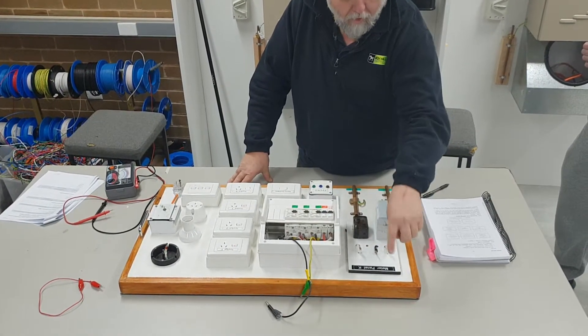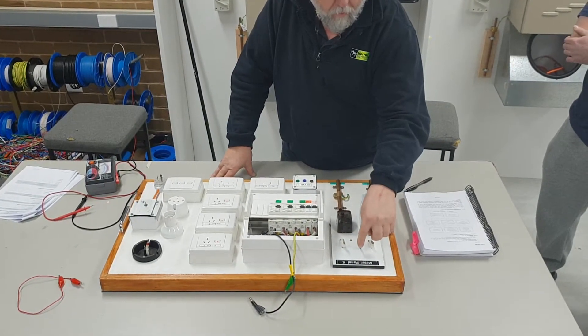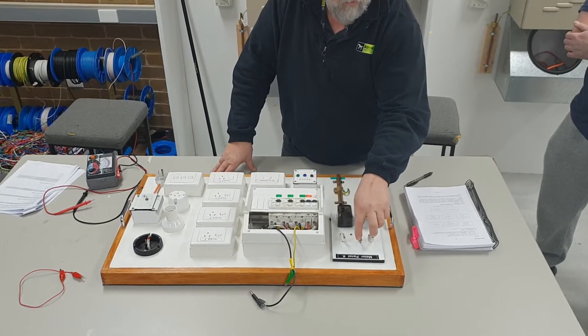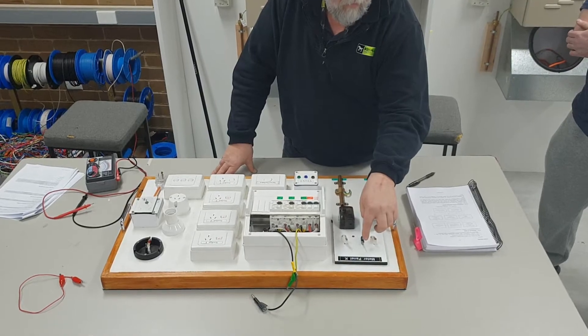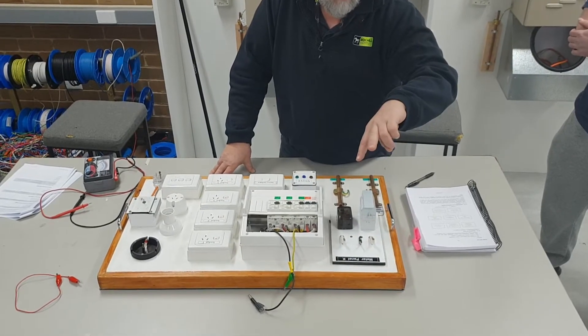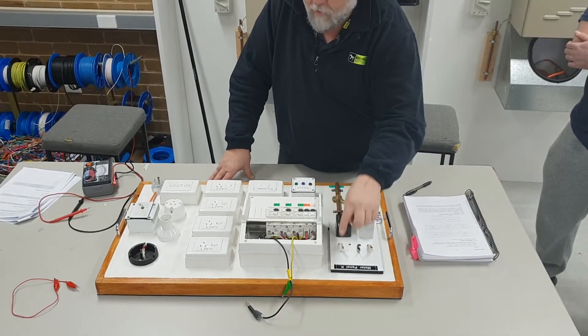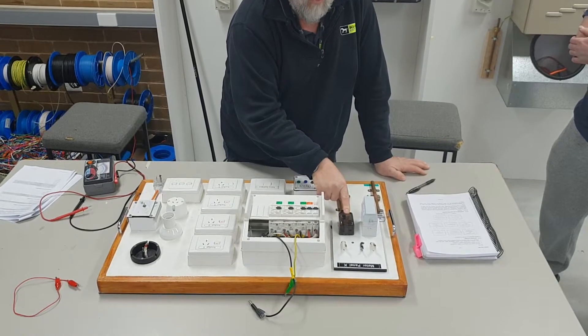The four mil neutral is only to give us voltage across the voltage part. A kilowatt hour meter is made up of both volts and amps - we have the voltage across the supply and the current going through the active. The neutral comes from here and goes to our neutral joining point from the bottom of what's called a link bar.